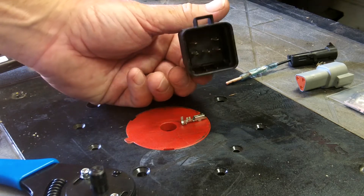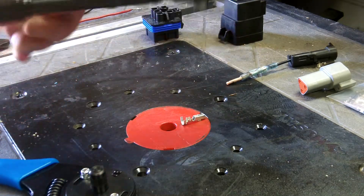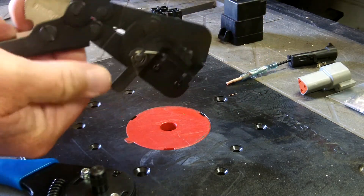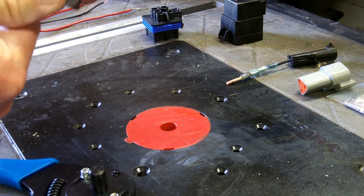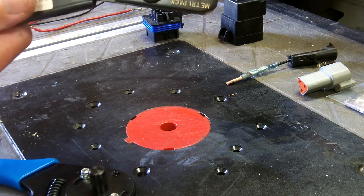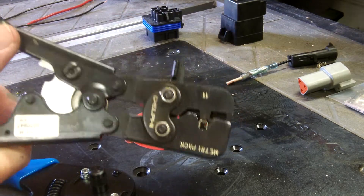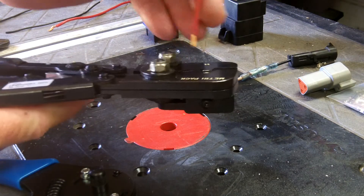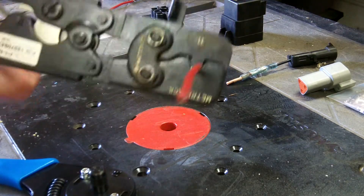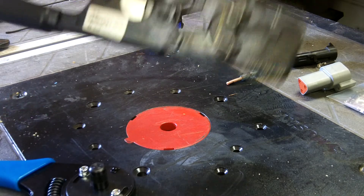The Tyco relays have flat pins — some boats have them, some don't. I don't know what the year change was but that's what I had to use on my boat. The Delphi pliers are pretty cool — they allow you to crimp onto the wire and the sheathing at the same time. It's got a little locking device to hold the connector in, and it just loads in, clips down, then allows you to preload the tension. I've got a piece of 14 gauge wire to demonstrate — just push it in there till it stops on the connector and start the ratchet system going.